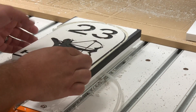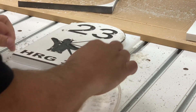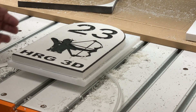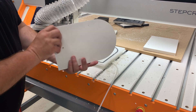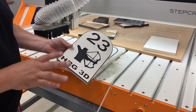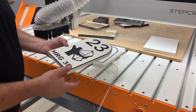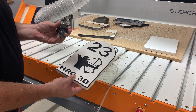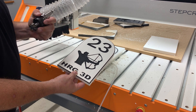That is all there is to it. As you can see, my workpiece is going to remain secure to the vacuum table. I can remove the waste material, turn off the vacuum pump, and that will release my part. And that's how you use work offsets. If you're using Mach3, you have work offset capability as well — if your software has G54, G55, G56, G57, that's what those are for. In this case it lets me use my automatic tool changer in a quick change format by simply pushing a button and swapping two tools, using G55 and G56 to take care of the Z offset for each tool.